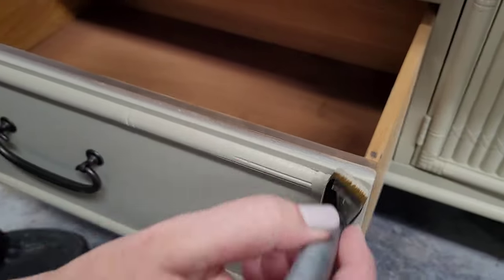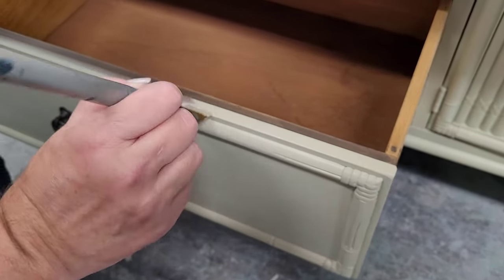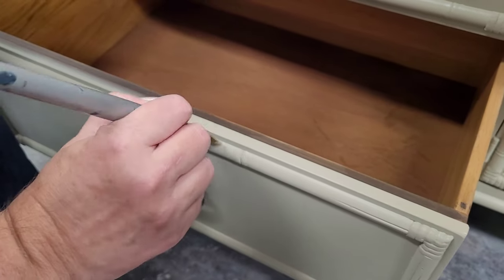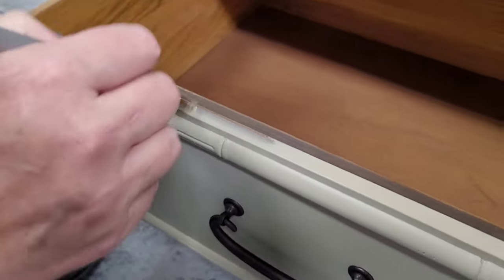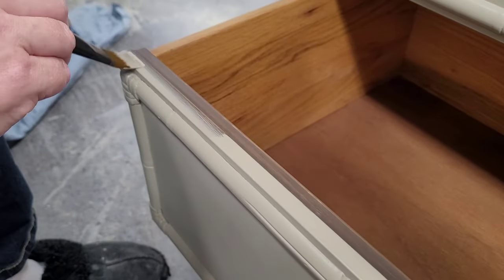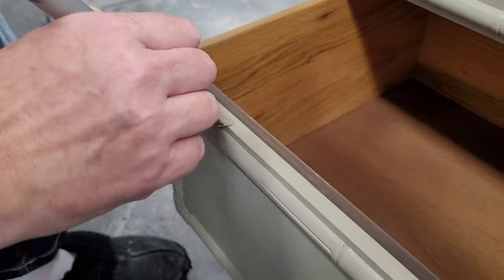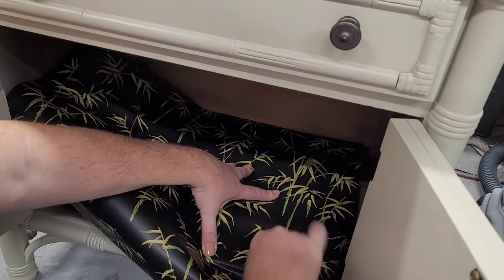While the hardware dries, let's finish up some other details. I sprayed the drawers with them inside the body, which means the edges didn't get fully covered — but there's no overspray inside the drawers, which was my goal. I'm using an artist brush to touch up with the One Hour Enamel along all the edges of the drawers. Making sure I don't skip these steps gives me the most professional finish possible.